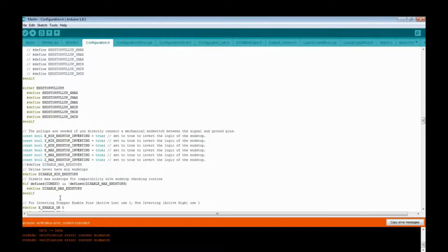101 Hero does closed circuit, open circuit to activate. It doesn't really matter. It does mean that if you have screwed up your pinouts, you've plugged them in wrong, it'll grind. Not something you want, but if you're fast on the power button, it shouldn't matter that much. But if you haven't set it true, either in this video or the next video, I will show you how to double check your end stops. Make sure they're plugged in right. Make sure they're working.